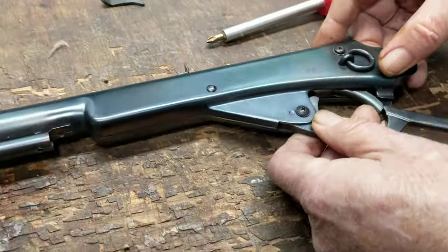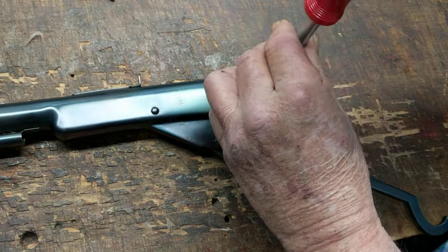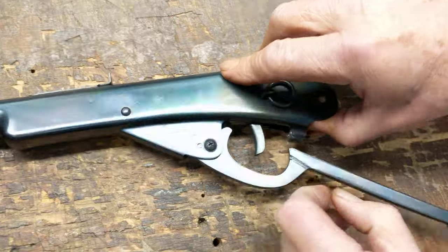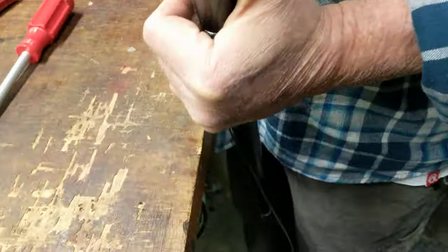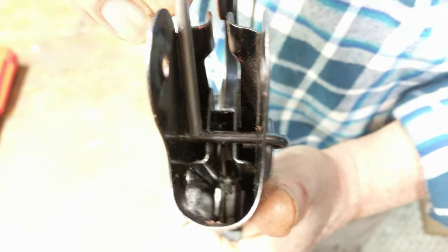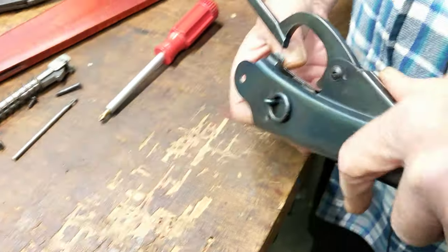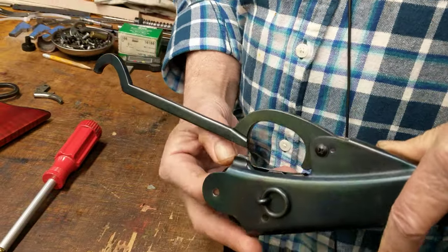The next phase is we're going to remove the trigger. We just pull the trigger bolt out. Now with these older Daisies that have the Latigo loop that actually goes through the receiver — you can see it right there — that is the Latigo loop mount. It traverses the receiver and it's going to be in the way. One of the things it gets in the way of is getting the trigger out, so you have to use a certain technique with the trigger because it will not just slide out like it will on a 111.